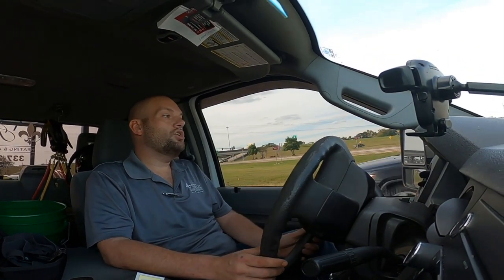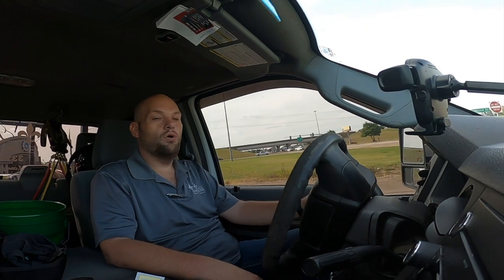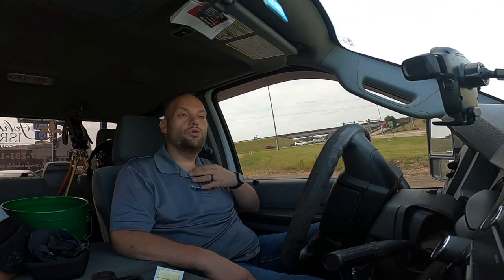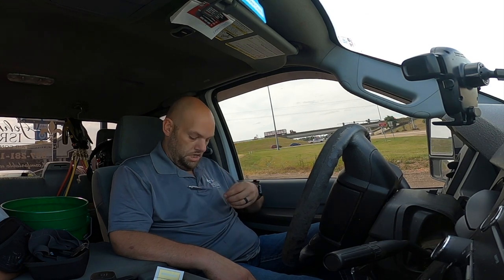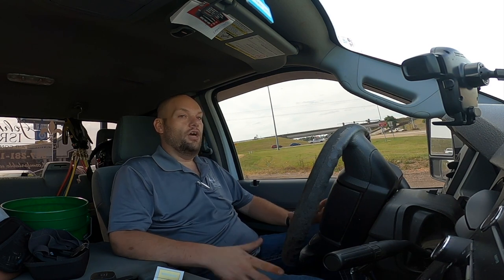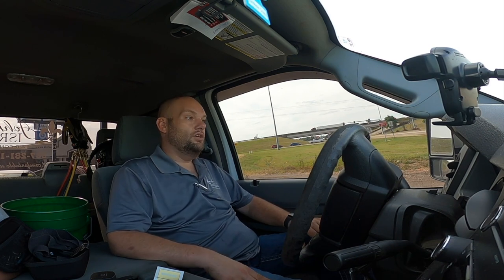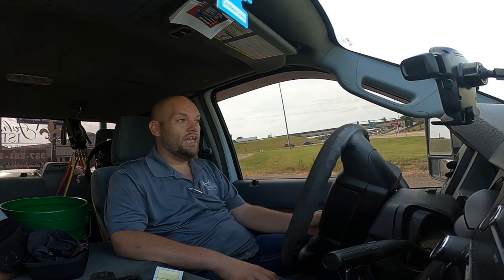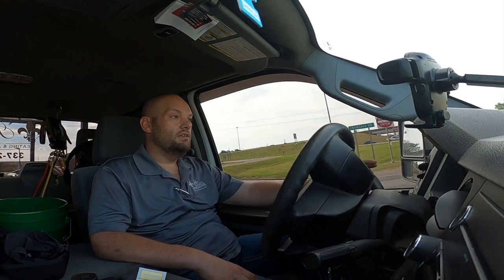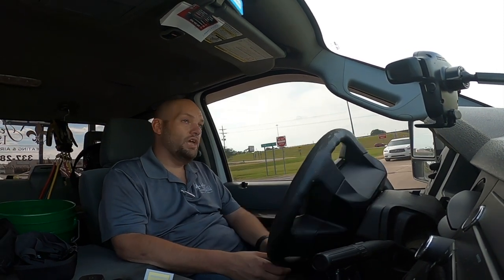So we did get a cold snap not too long ago. And he called me and he said, hey, John, that new unit you put in, it doesn't heat up as good as the old one did. And I was like, yeah, that's on me. That's my bad. I dropped the heat kit from a 20 kW to a 15. And he asked me if I would come back and put a 20, and I said of course.